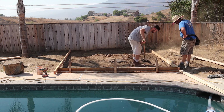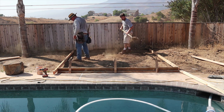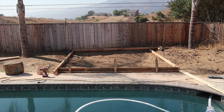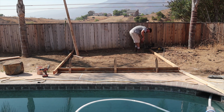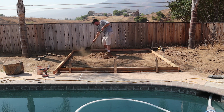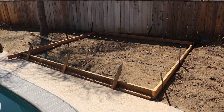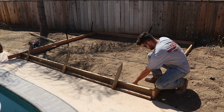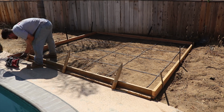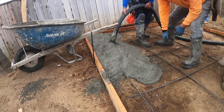I came around here with my little skid steer to move some of this dirt out of here already, so it's real close. In any case, if it's over-excavated, I'll just pour it deep because I don't want to throw any loose fill onto native undisturbed soil. So we just pour deep in that case. As you can see there, we're deep along the nose here. So I just ripped some boards to put underneath so we have a nice smooth side all the way down.